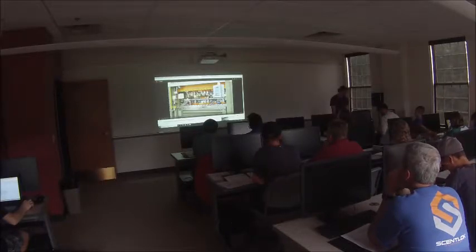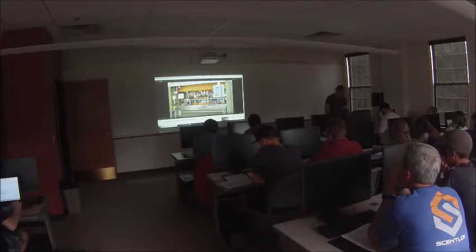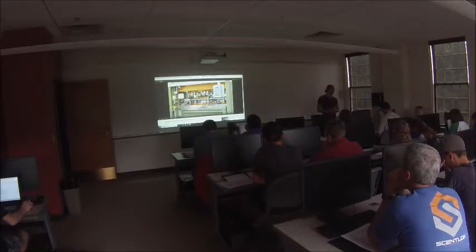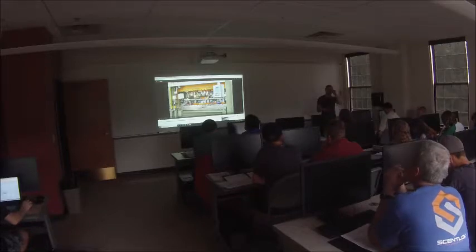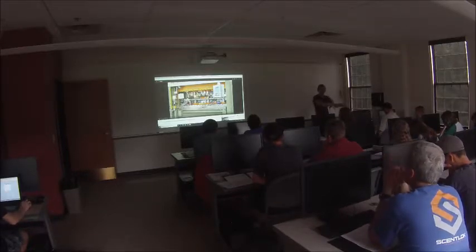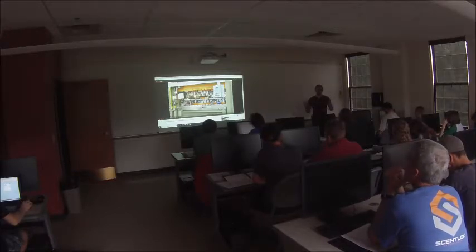Okay, so we're going to talk about bending first. Bending is typically for sheet metal and plate. Flat pieces, you bend or fold them, as it's sometimes called, to make flanges and tabs and things you can use. We use a laser to cut flat sheet, and then you use what's called a brake, which is basically just a bending device. There are several different kinds of brakes.